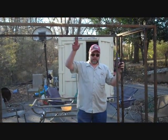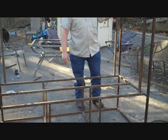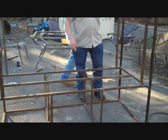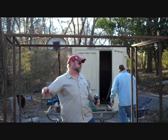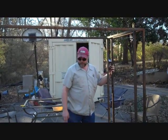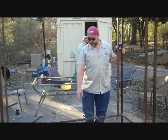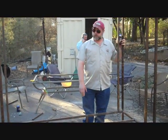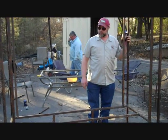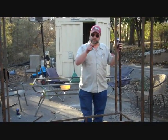What we did today — we got the cross members in here which are going to be supporting the floor and the water pan. We put in six vertical members, the two down at the bottom horizontal members, the two up at the top horizontal members, and then the tall vertical members. These are going to support one of the inner walls; this is going to support the water pan and the floor. These are going to have some angle iron slides on them, and down here is where our firebox is going to be, with the chimneys on this back part. So we got a lot done today — we'll be fabricating our chimneys, then start to build out the interior. Stay tuned to the Peg Leg Porker Channel.